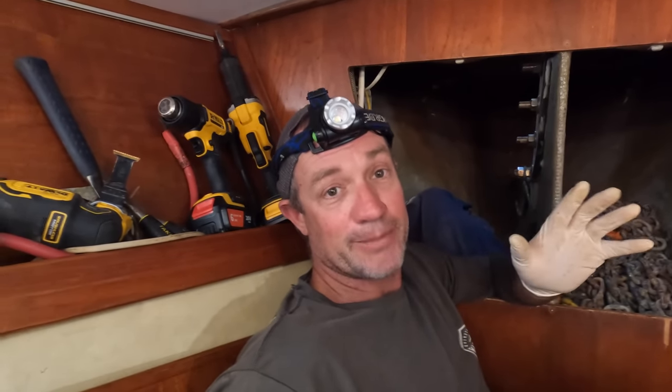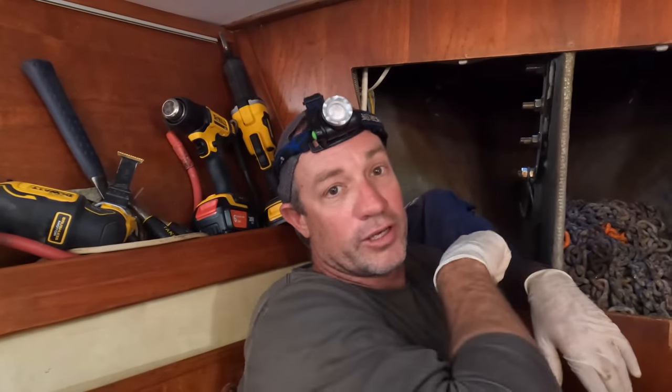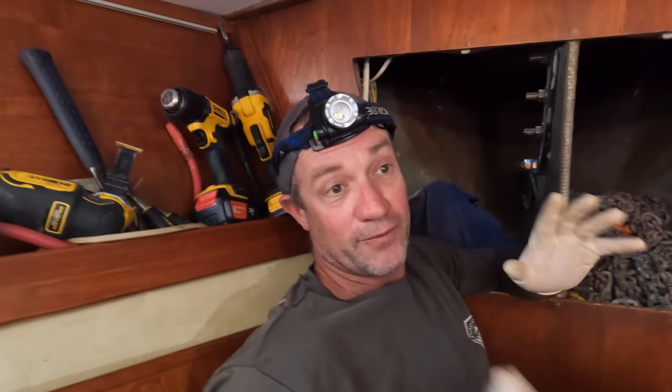We had a snubber on our last boat and it actually flicked off while we're in the big sea, so all the load transferred to the windlass, which is definitely not ideal, taking bend shafts and do all sorts of damage. But also, if it's not fixed to the boat properly, you can lose the whole lot or rip part of your deck up.